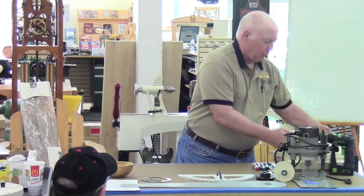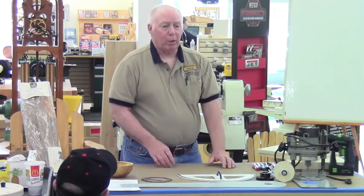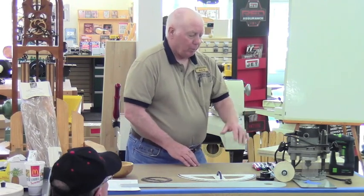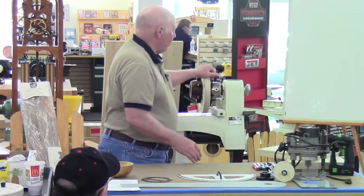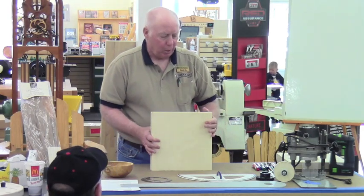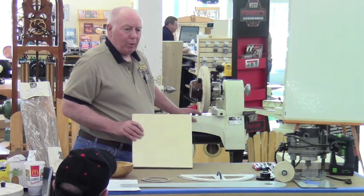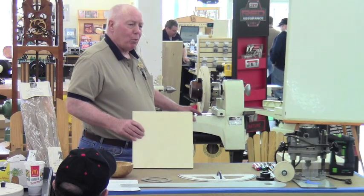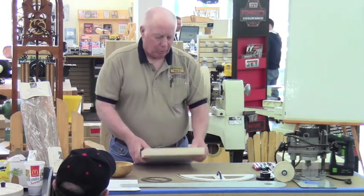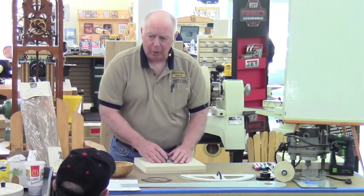So what you want to do is decide how big this thing is going to be — it can be as big or as small as you want. The only restriction is you don't want the buttons all the way in too tight to the ring or faceplate. In the case of a 12-inch lathe, we're going to lay out a 12-inch Longworth Chuck. You can see there's not a whole lot of clearance. When you cut these things out, cut them about a quarter of an inch larger — so for a 12-inch lathe, it's going to be 12 and a quarter by 12 and a quarter, which gives you a little fudge factor.